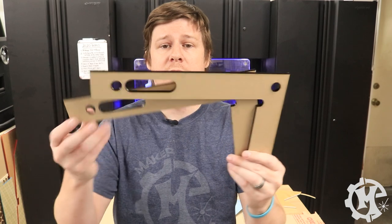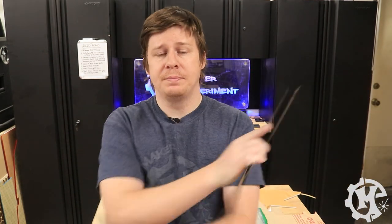I've gone ahead and cut a couple of first testers — these are both black acrylic. These are not going to be as accurate as a metal square, so they're not going to be a precision tool. They're more of a colorful novelty type of square that are just fun to have in the shop; the ruler will still work, but as far as checking for square, this is not going to be as accurate as the metal 1281 from Woodpeckers. What I need to do is peel the paper off both sides, lay them back into the piece I cut them out of, engrave the design, swap spots with them so they go into the others to get the mirror image and engrave again. Then these will be ready for some face plates.